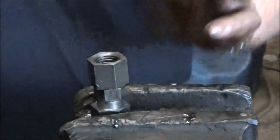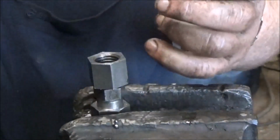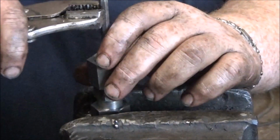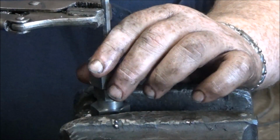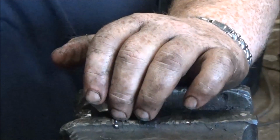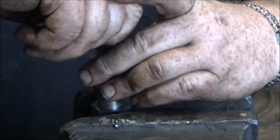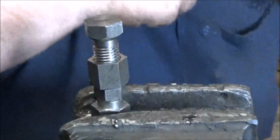So what I would do is fix my hose with this connection, and then the next day when you're in town, just order a new hose, or order a new hose and line off of me, and just give it a nice little squeeze, and it should squeeze up like that. Now I'm going to blank this off for testing, and I'm going to put my blank on, and I'm going to tighten this up.